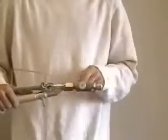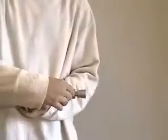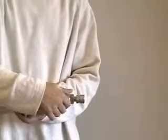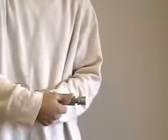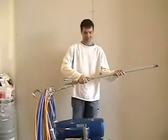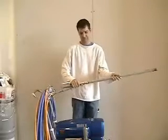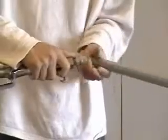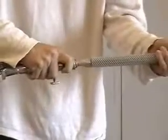Notice that the trigger valve has a material flow valve and disconnect fitting. Turning the material flow valve clockwise reduces the material flow and counterclockwise increases the material flow. Attached to the material flow valve is the quick connect. You can attach poles for taping, finishing, or texturing to the quick connects. To attach any pole, pull back on the sleeve, connect, and release.